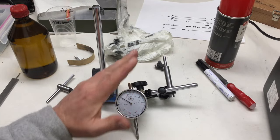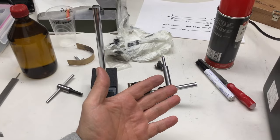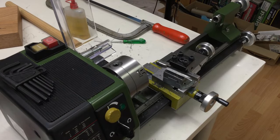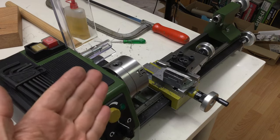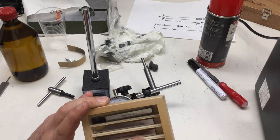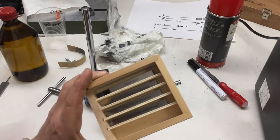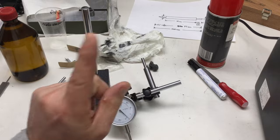That's it for today. I'm overall quite happy with the outcome. However, mild steel is a little bit harsh for such a big part on my little lathe. In the end it got it done, but I have to admit this took quite a toll on my tools — the parting tool I hate is completely broken and needs to be reground, and the other tool still in the machine shows signs of wear and tear too. What will we do next time? I'll give you a hint — till then, bye!